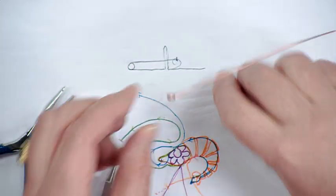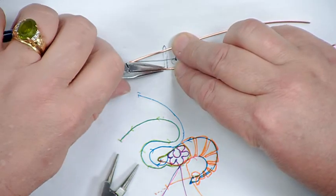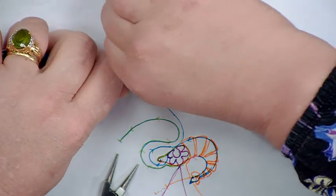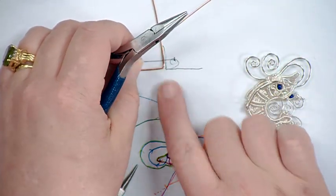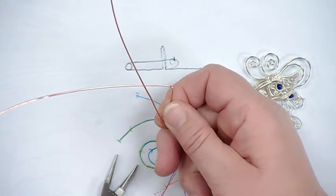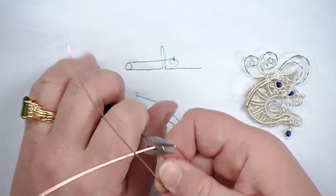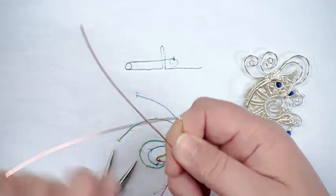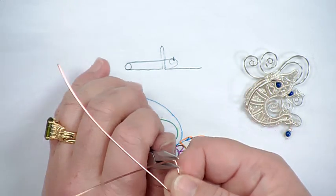So it'll catch better. Placing this back over the diagram, I want this upwards, straight upwards, 90 degrees, and that'll start forming that catch. That's quite a round bend, and we can sharpen up a bend in several ways by clamping either side of the bend, there and there. A clamp and a clamp will start to make that bend a 90 degree bend, not a curvy bend. And then clamp and clamp again.